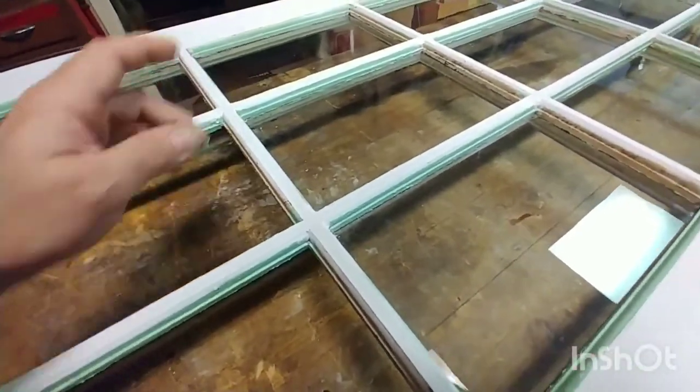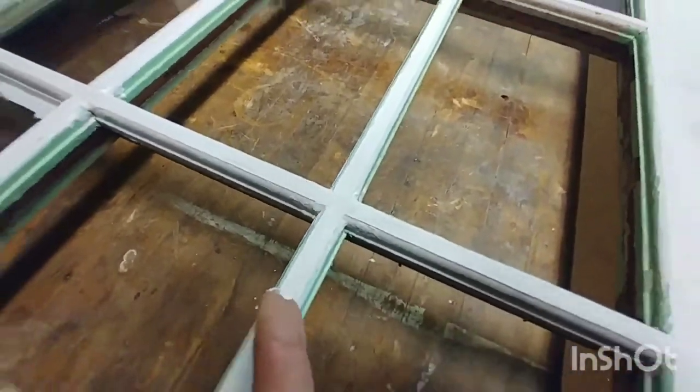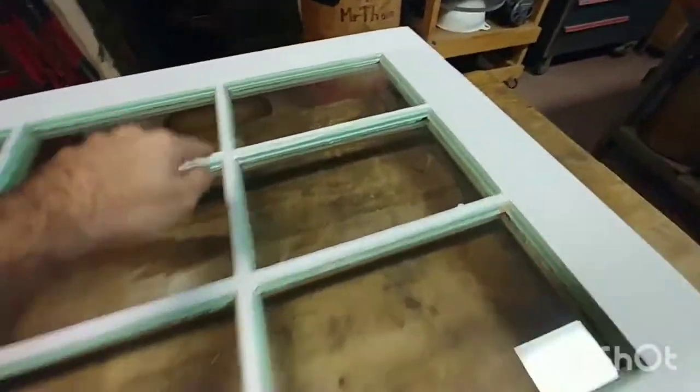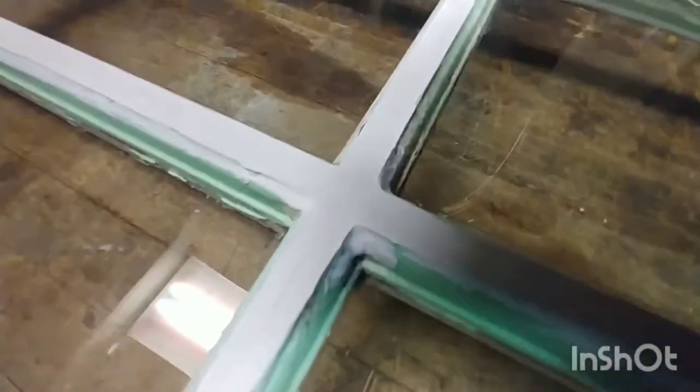And then the last move that you make is to brush through it accordingly. Now, the way that these were fit, the horizontal crosses the vertical. So while I painted the verticals to get that grain correct, and then I pulled through the little horizontals to make sure that grain in the end is the primary direction on those little spots as you look at them.